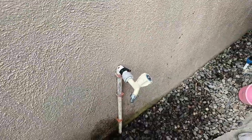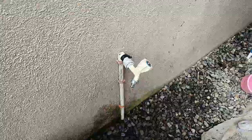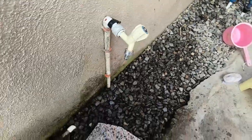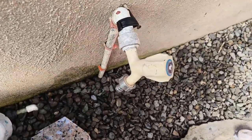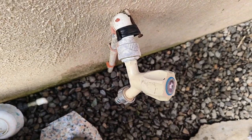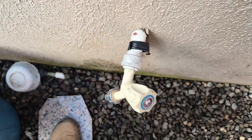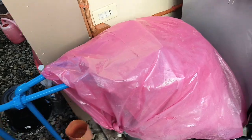So this is the first open line or water spigot that comes directly from the city water. And so you see already, I know you're thinking, uh-oh, that's problematic. Yeah, because right here you can open this water spigot, and then the rest of the house isn't going to be fed any water supply. So that second line, I don't want to mess with this too much right here. I think this is properly placed and they could use it for laundry. So we take the second line and we tie it in over here is what my thought is.